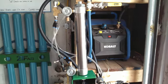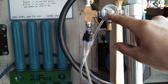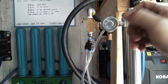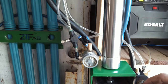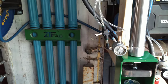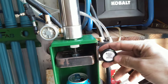This is a pop can smasher I built. It uses air-piloted valves — this valve is closed until you supply air to the back, then it opens, so all the pressure goes through the valve instead of through a little control valve. It also works as a quick exhaust, which is what those are for. This part is just to slow it down coming up.